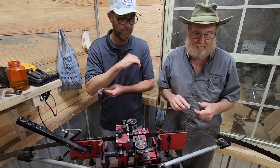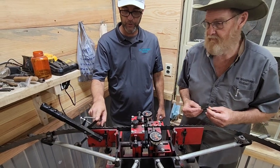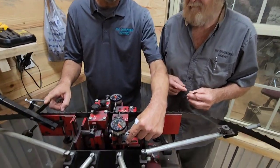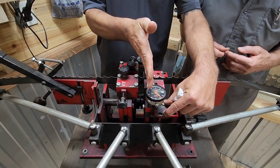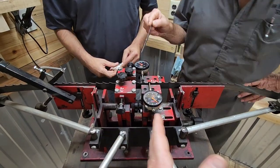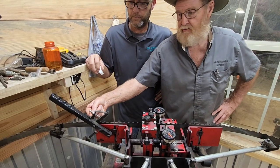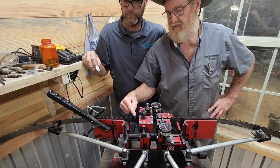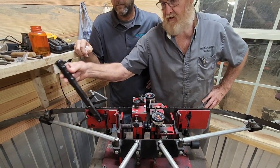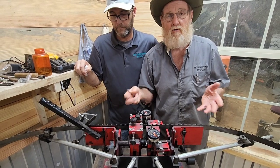This is a seven-eighths, two-inch spacing blade. If you're changing to a three-quarter spacing, you have to adjust the push — you can either shorten or decrease the stroke length. You also have two bolts for each indicator which you loosen and it will move the indicator left or right, closer to a three-quarter blade or out to a seven-eighth-inch position. We usually keep one indicator fixed and only move the other one. Running the adjustment screw in or out increases or shortens the stroke length, and then there's a knob to raise or lower the handle position — Howard and I have different preferences there, and neither is wrong.